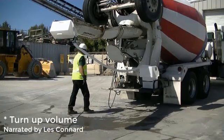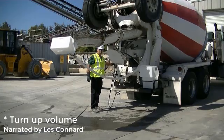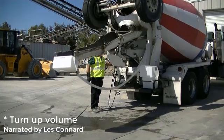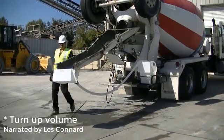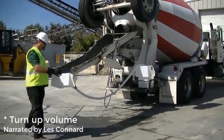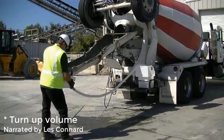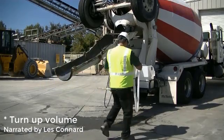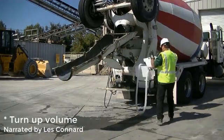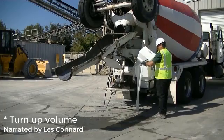We're going to lower the chute. We're going to leave the hose attached and take the receptacle over to the bucket and dump any aggregates and water that are remaining in that so that we don't spill anything on the ground. Once that's completed, then we'll feel free to unhook our hose and again stretch it out to get all the water out before we roll it up. So just dump any remaining solids or water into the tank.